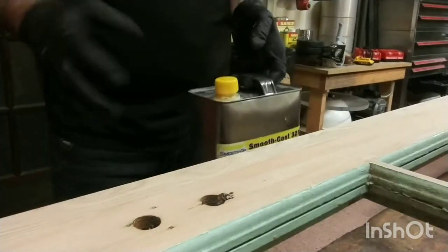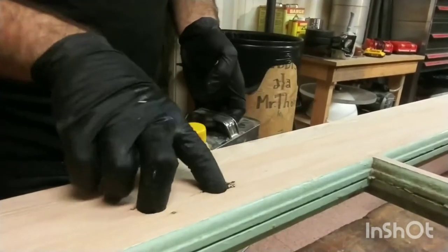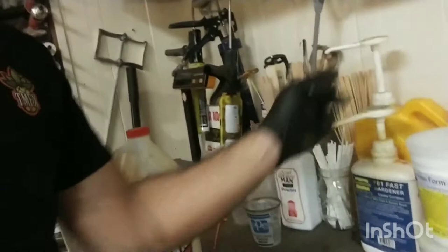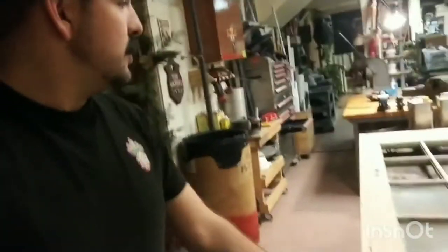When it comes to filling things up with resin, you don't want to use a laminating resin. I don't want to go off on a tangent too far, but I've got an epoxy system from Smooth-On here for laminating with fiberglass. They're metered pumps, one pump of catalyst, one pump of base. The volumes are in the right ratio, so you can do 5 pumps of base, 5 pumps of catalyst, for however much volume you want.